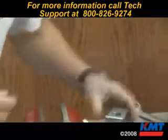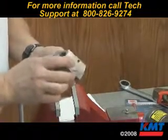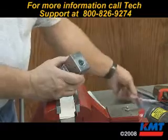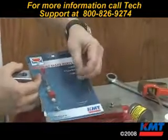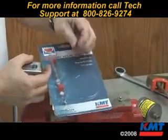Clean your body real well, inspect the bore for scratches, blow it out with air, and always replace the parts as a kit. The kits come like this. It has everything in it except the stainless grooved ring. It's a non-wear item and you shouldn't have to replace it unless you lose it.